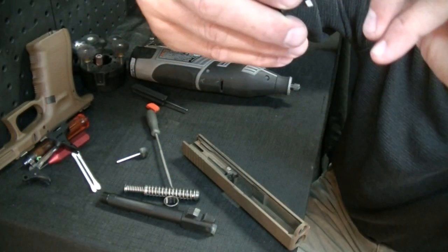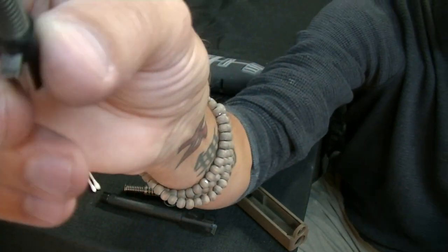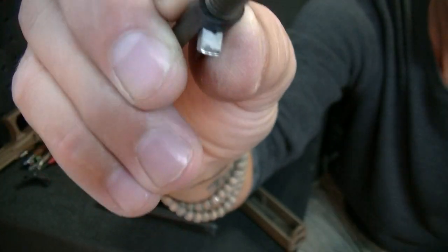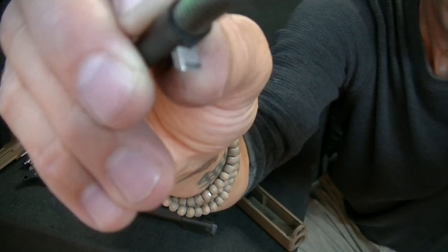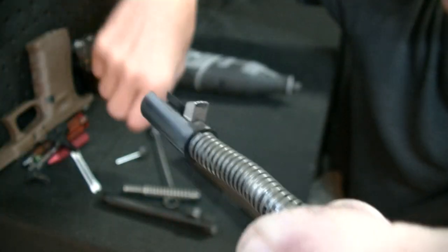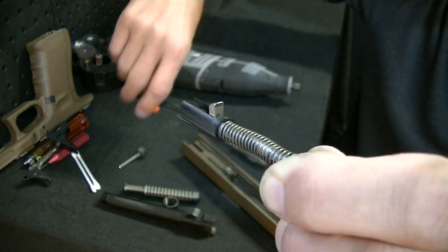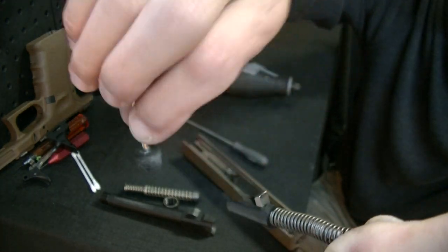Let me get real close up — see the tooling lines on the striker? They're going around in a circle, and you can see marks right here. This is a major, major point of engagement. I had a video where I was going to show you how to work on it, but I decided not to. The reality is you really want to get this area as smooth as possible. All it takes is 1,000 or 2,000 grit sandpaper, then hit it with the Dremel with some Flitz or Mother's Magic right here — it's going to be glass on glass.